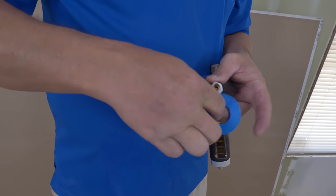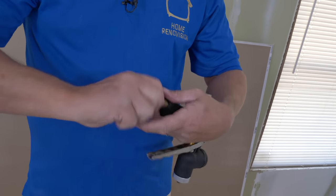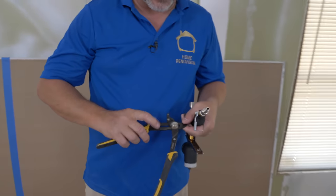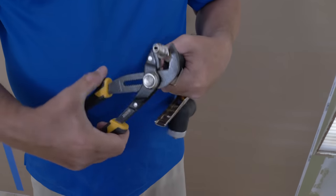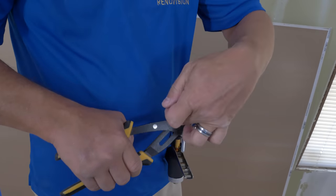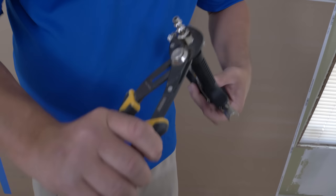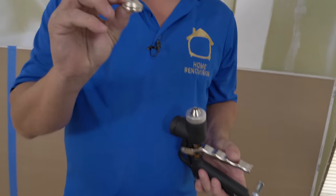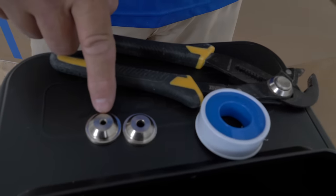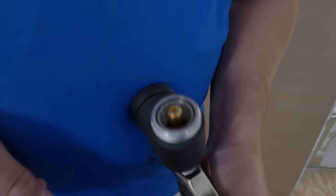Make sure the tape is not sitting over the edge. When using a wrench, hold it with the curved neck underneath going clockwise — that gives you the power. If you hold it the other way, the only power you have is squeezing the two bars together and it'll slip off. Clockwise with the curved neck underneath will make an eight-year-old child strong enough. The hopper gun comes with different size nozzle holes for different kinds of texture work — a small hole, a medium mama-bear hole, and a large papa-bear hole. Just undo your neck and it slides right off — and there's the O-ring.